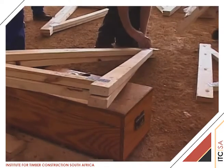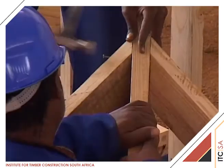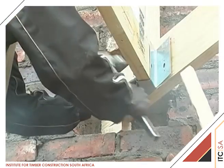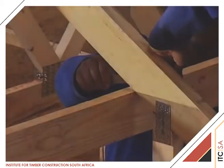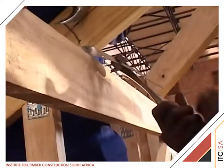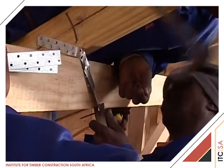The smaller jacks, J2 on the layout, are then fixed from the wall plate mark onto 45-degree truss hangers nailed against the hip girders. The rafters of all trusses passing over the horizontal top cords of TG2 and TT1 are now securely fastened on the horizontal top cords using a hurricane clip or pre-punched strap connection, as shown on the detail on page 21 of the volume 2 handbook.